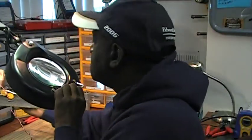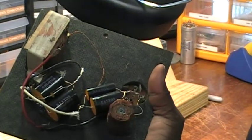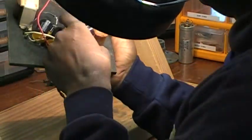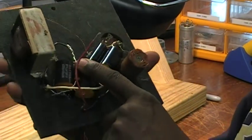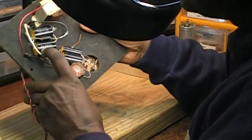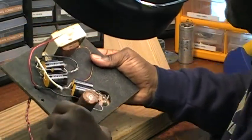What I have — I'll have to use my glass to look in here — is two capacitors. I'm using Dayton capacitors: 5.6 microfarads and 2.2 microfarads. So right here, you have a 5.6 microfarad capacitor and a 2.2 microfarad capacitor — that's for the treble side, that's 7.8. Then you want 12.5 over here. I have Dayton capacitors: a 6.2 and a 6.2, that's 12.4, and then a 0.1, so that makes it 12.5 for the bass side.